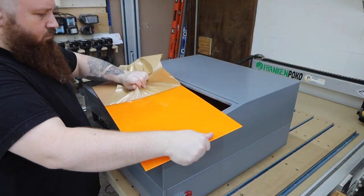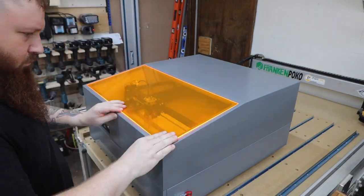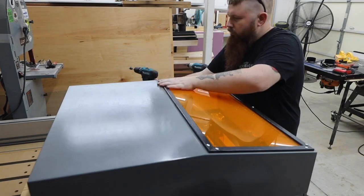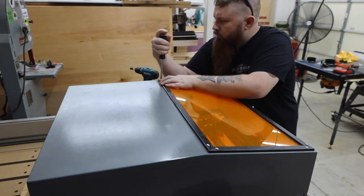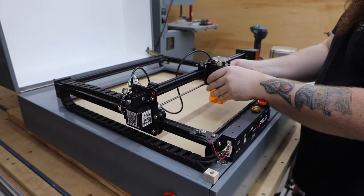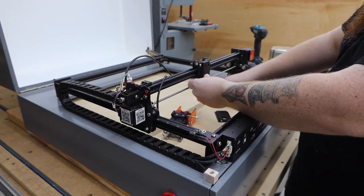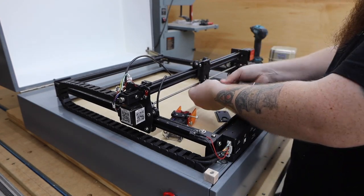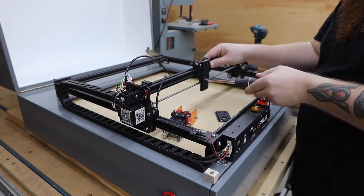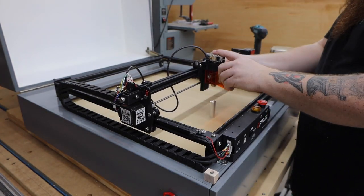For the screen, I'm using this piece of orange acrylic. I'm not convinced this is the right stuff for use with a laser — a lot of the reviewers said that's what they were using it for, but it wasn't stamped with anything saying it was approved for use with lasers. Do your homework and make sure you get the right stuff. If in doubt, wear your tinted safety glasses. I wanted the laser to be able to go a little lower, so I designed a new bracket and 3D printed it. Eventually I'd like to get one of the thumb screw height adjusters. This new bracket works great for now.